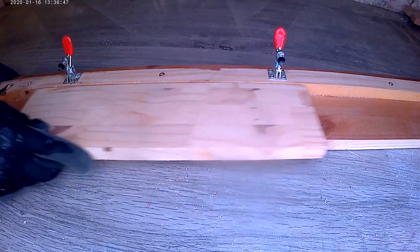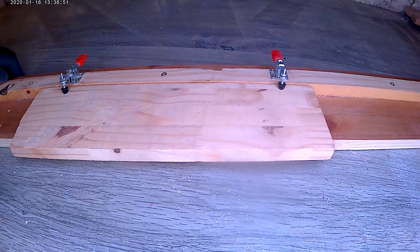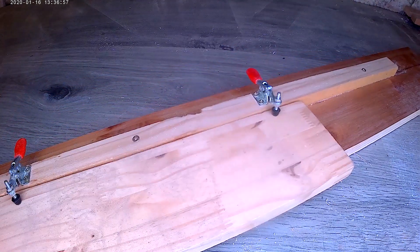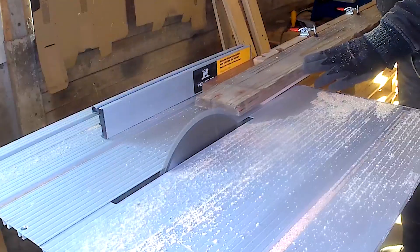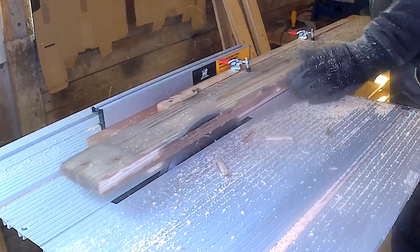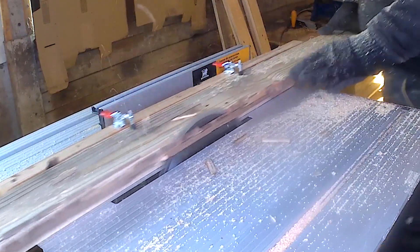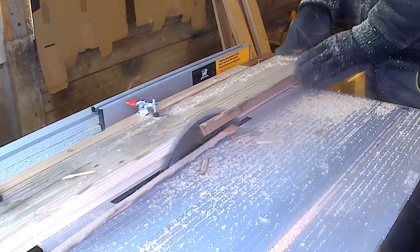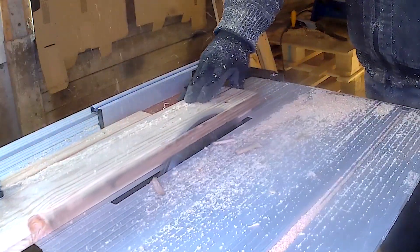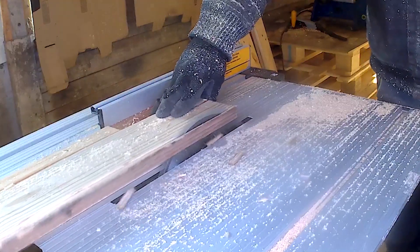Let's go for our little bonus. Here is another jig that I have done. You just need to clamp a piece of wood with two clamps and then the back side of that jig is already flat thanks to my jointer, so I can just put that side against the fence of the table saw. This allows me to get the side of a board flat without using the jointer. My jointer doesn't have great quality and isn't really powerful, so this can save me time — for example making panels by getting two sides flat and parallel, then assembling a big panel with all the slats together and finishing it flat with a hand plane or a planer. I am also happy with the second jig — you can just make a rip cut with that one, so you can go straight into the wood.